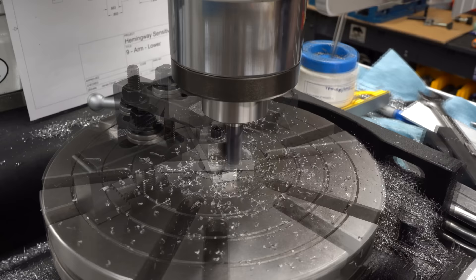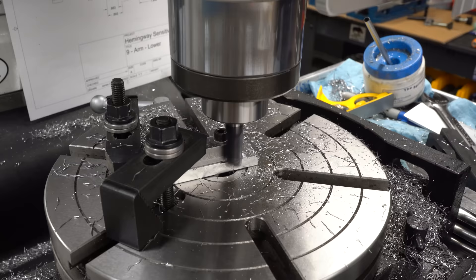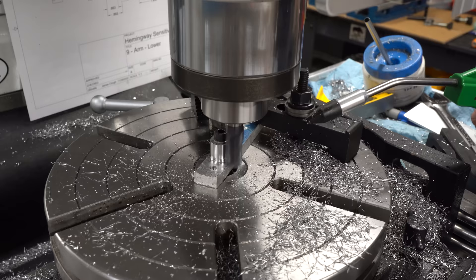I start by clearing away some of the aluminum to make room for the end mill to work. I'm using A9 on the aluminum, which does seem to help with chip welding on the end mill. Then just like every other part we've done today, I work down to about a thousandth of an inch off the tangent point, work it around, and clean up that rounded end. And just like every other part today, the surface finish turned out beautiful.